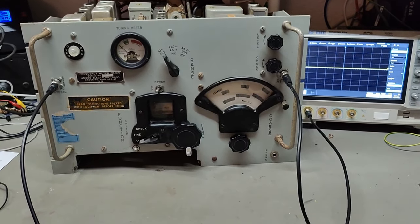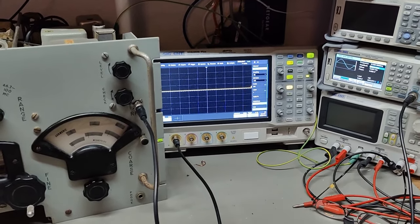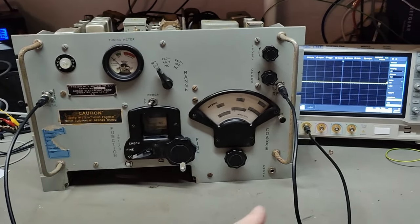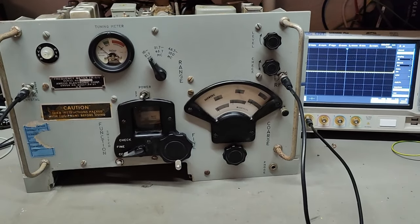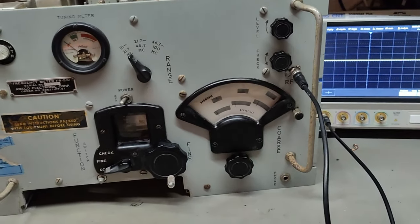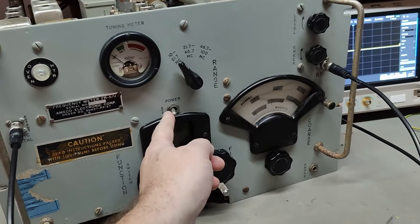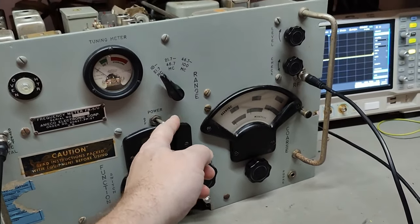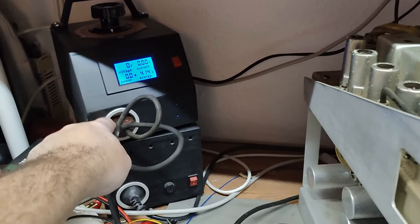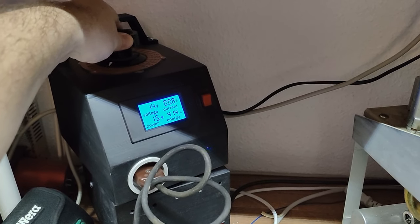I think I will try and power this up and see if it takes the fuses or whatever it's doing. I have prepared a little bit with a signal generator for 15 MHz and a scope for the oscillator output. I adjusted the coarse for 15 MHz and I think I am in the right range — it should work. So I will crank on power here, and chassis is grounded. I should be able to turn this on and then slowly crank up.